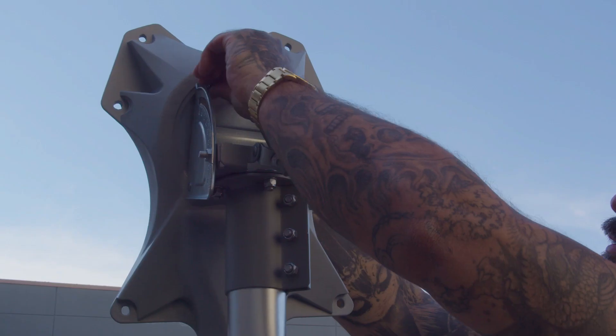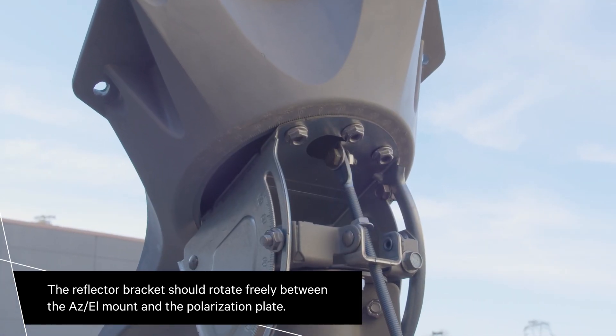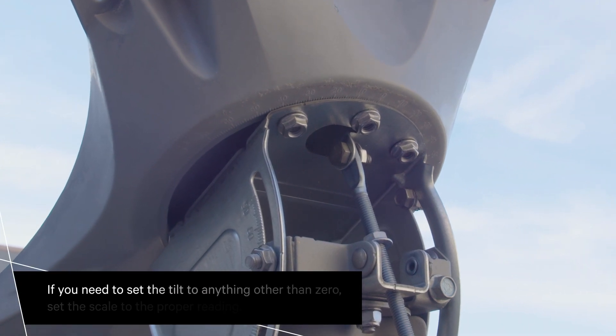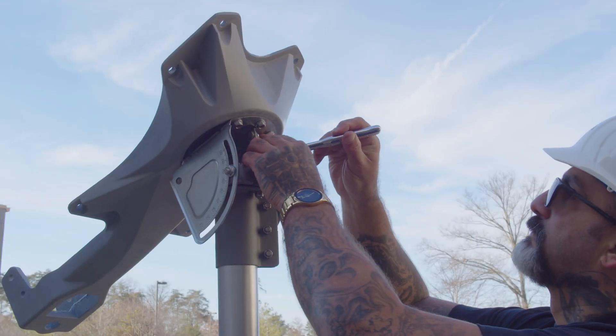From the opposite side of the reflector bracket, place a hex flange nut on each bolt and tighten the nuts slightly, only until snug. When the reflector bracket is correctly attached to the AZ-EL mount, you can see the tilt scale numbers above the tilt pointer. The tilt pointer should be set to zero. Lock down the five bolts.